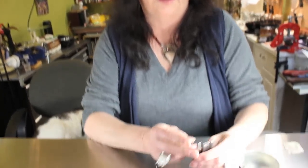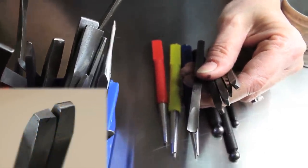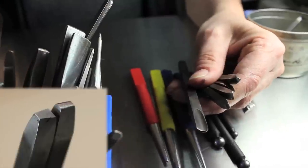If you buy commercial tools, you need to be aware that when some tools come from the manufacturer, they aren't finished. This one in particular — you can really see the sharp edges on here, and they need to be rounded down. If you have a sharp edge like this, it's going to tear the metal and get stuck. The concept behind chasing and repoussé tools is that they glide across the metal instead of getting stuck in there. I'll show you how to finish them later on too.